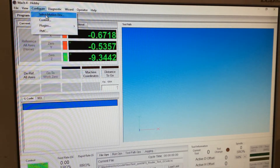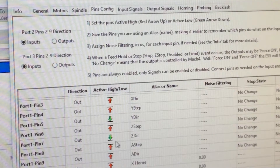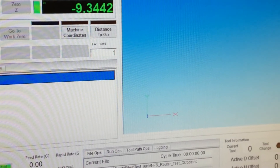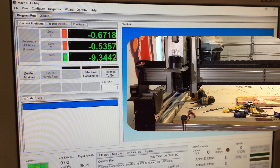The problem we've got here: we've got to come down to pins configuration, and all these sensors need to be active low. If you go active high, for some reason it's a quirk in the plugin for Mach 4 and the ESS — it'll make it read the back-off velocity first. So now we've got to click OK. Chances are, since we've changed the way that sensor works, our homing directions might be wrong. Let's see what happens.